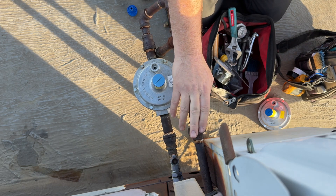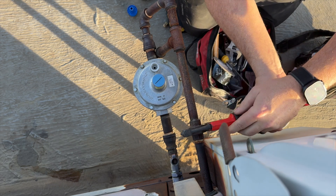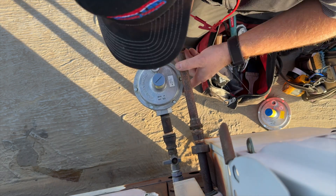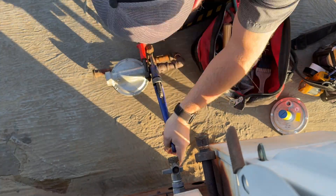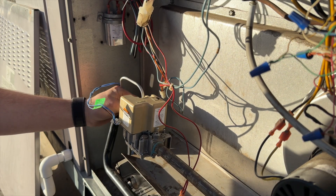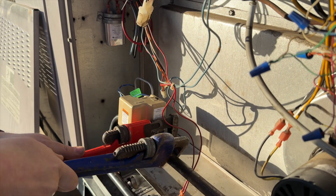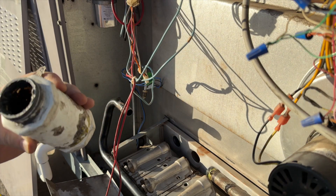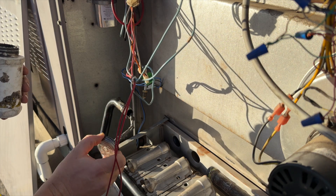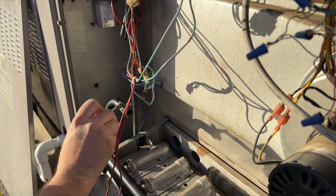So we're going to break this here at the union. This is a spud wrench, also known as a monkey wrench, which is great for gas valves and unions. We're going to take off the pilot tube here — that's a seven-sixteenths wrench to get that unscrewed. This is called pipe dope. I brought it with me from California; I haven't been able to find it in Oregon. I don't use tape — I know a lot of you say I'm supposed to use both, but I've had luck with this.